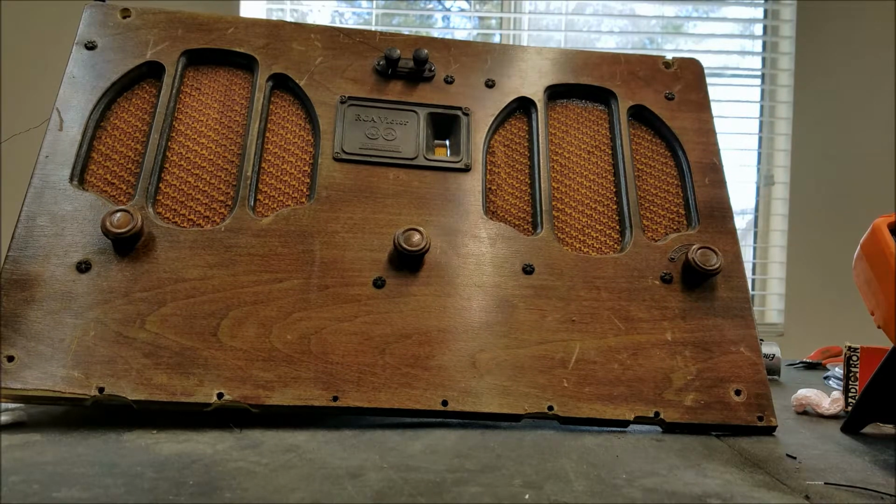See, it was louder than when I turned it off. And it seems like it's slowly dying off. So definitely seems like something's drifting as it's getting used. There are only a couple of options that it could be: either resistors drifting, tubes warming up and drifting or shorting, or capacitors shorting as they get warmed up, or getting leaky.